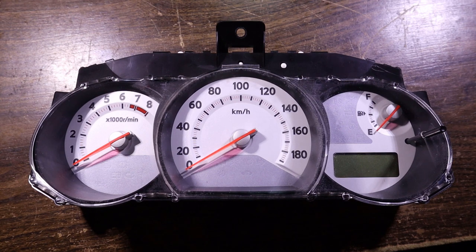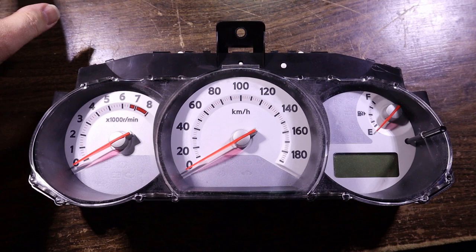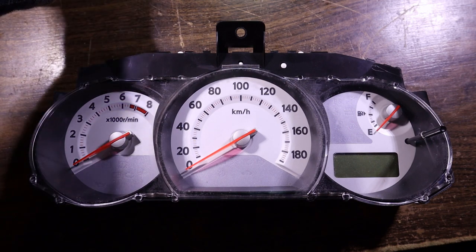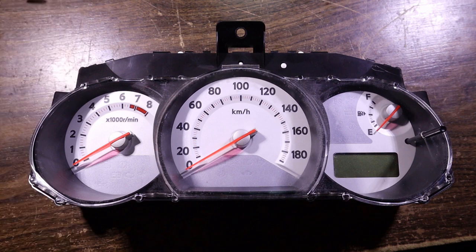Also, power can only flow through a diode one way, so it's not going to be a pin that should have a signal coming out of it. So you're pretty safe bet that's where you're headed. But by all means, look up a wiring diagram if you want absolute certainty.